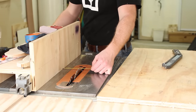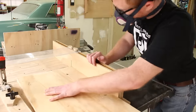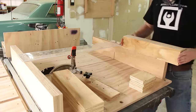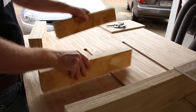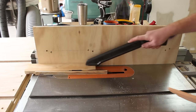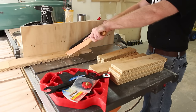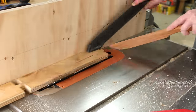For molding the column sides, I did have to make a special flask. The other flasks that I have weren't big enough to mold this particular part. I pretty much followed the instructions in the book, although there are some techniques like using pocket holes that weren't mentioned in the book. The ribs are mentioned in the book, as well as having a little dado cut on the interior sides of the flask. I put a little chamfer on the lower edge of the ribs.